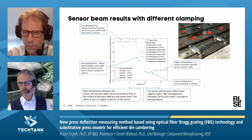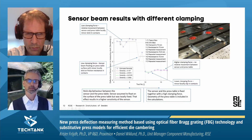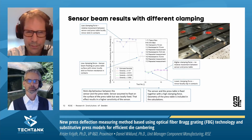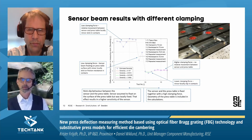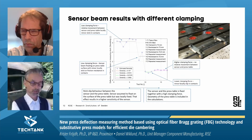In this case, we also had oil in between the table and the sensor beam. The result was poor correlation between the sensor beam and the reference system, because we had some stick-slip phenomena. The optimum strategy for fixating was to have a fixed connection between the sensor beam and the table, and then we had a good correlation. In that case, you need to consider the distance from the fiber to the neutral layer of the table when you calculate the deflections.